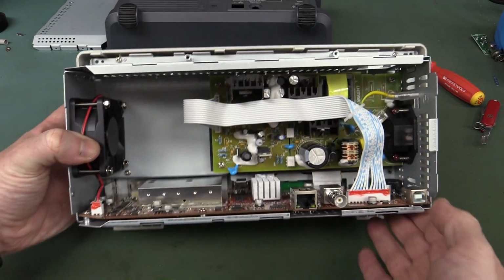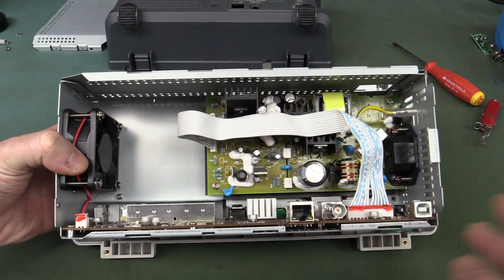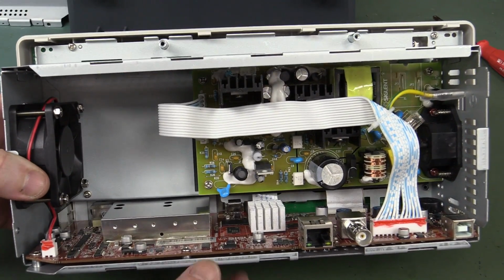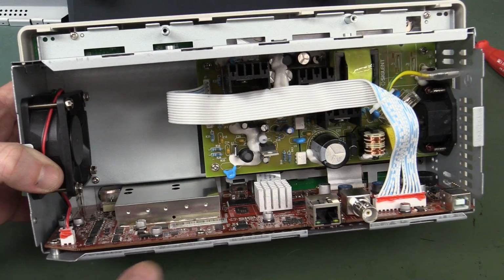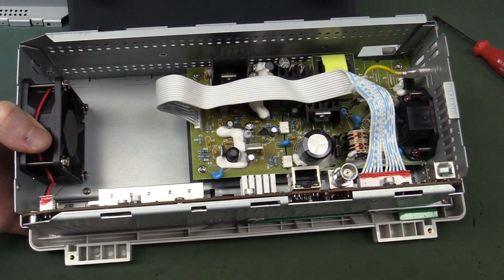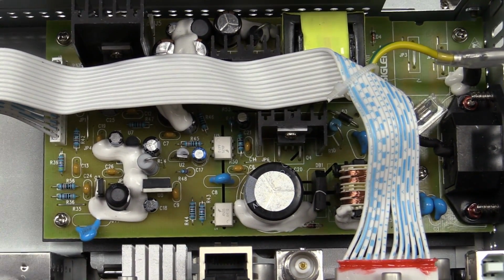They've completely separated that. Single board construction down the bottom. We'll have a look at that. But that's interesting. This is supposed to have a 500 microvolt front end, but of course it's all shielded, so no worries. They're probably not hugely concerned. There's nothing inherently wrong with that. It looks quite neat and tidy, actually. I do like the look of the power supply.